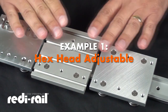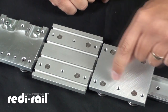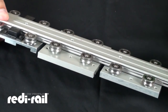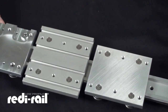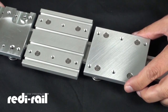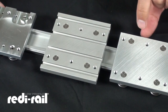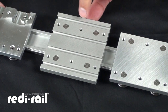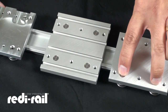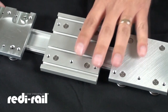Here what we have is the original design for the low-profile ready rail. You'll notice immediately these cams — the double-row ball bearings that ride on these hardened steel raceways. These are fixed on both sides, they come factory preset, and they work quite well. The overall height here is 19mm for both of these styles of carriage.